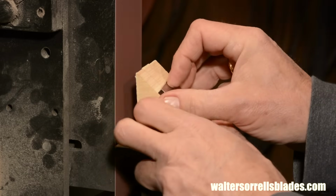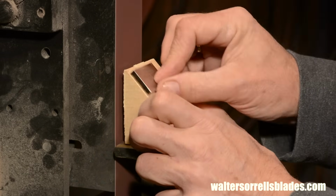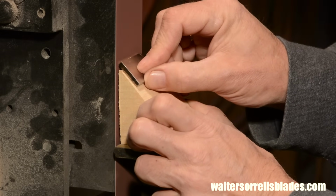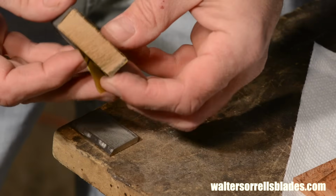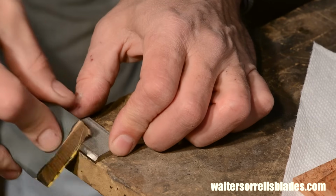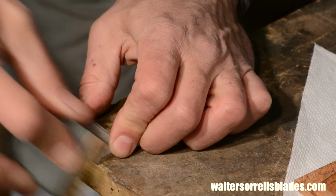So, I'm going to go ahead and grind a little compound bevel into the bolsters using a piece of scrap wood as a jig. Then I'll clean them up with sandpaper, sanding them right out to 1200 grit. They'll get little scratches while I'm doing other things with them, but after this, they'll only need a tune-up to look perfect.